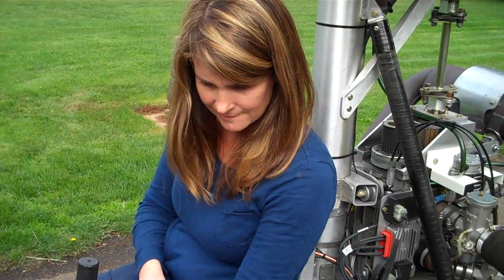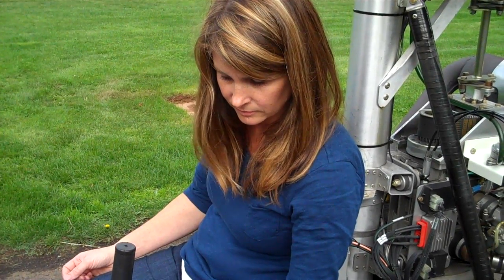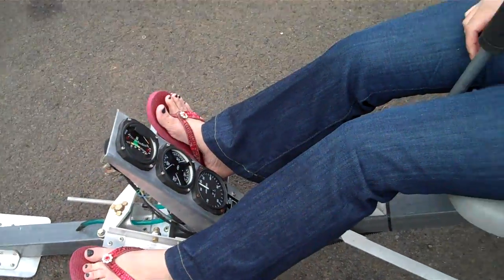So what do you do to get up? Well, you start it up and warm it up. Then you increase your throttle until you get up into the right RPM range and your rotor speed comes up. Once your rotor speed and RPM are in the green arcs, you just pull up on that handle and you go straight up. As you do that, you're going to have to use a lot of left pedal because it's going to want to torque around the other direction. Your body has to learn how to fly these things — but once you get it, it's like riding a bicycle and you never forget it.